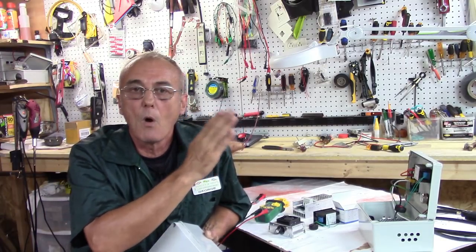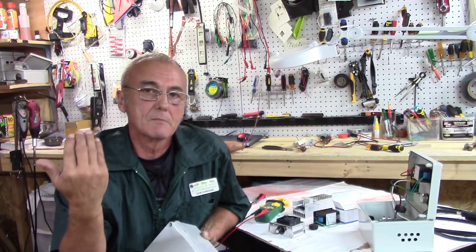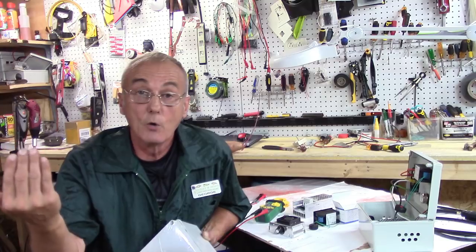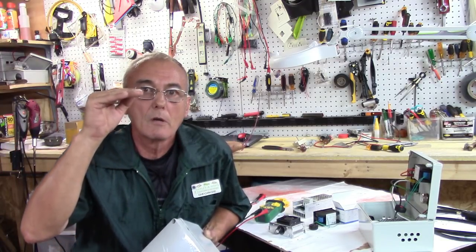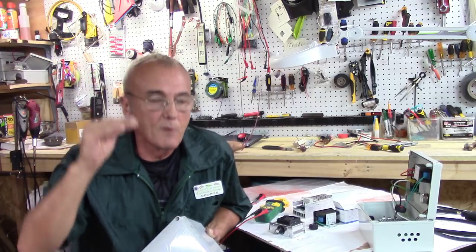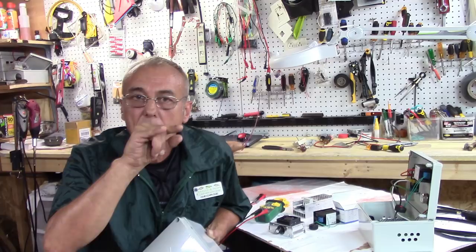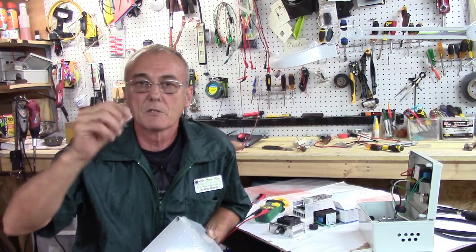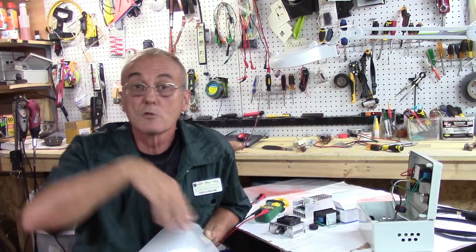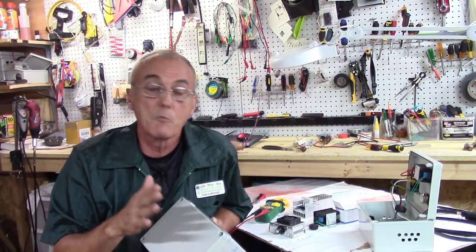Well, then, even though all of that power is available, the average power that's seen by the circuit or the load is going to be equal to that. So your amperage reduces and your voltage reduces proportionately. And if you increase it to 50%, of course, your amperage increases and your voltage increases, all the way up to 100% if you're using the full sine wave. That's basically the theory of how this thing works.